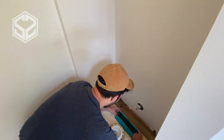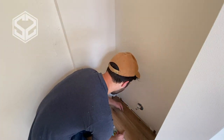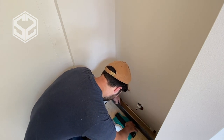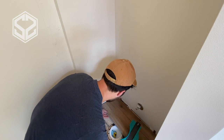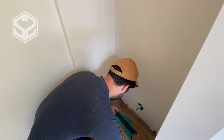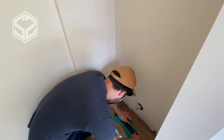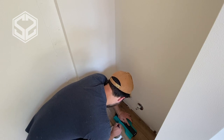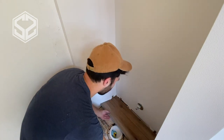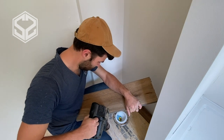Like I mentioned before, I'm starting in the corner where the toilet's going in this little cubby and I need to cut the flooring to fit around the flange perfectly. I don't want to leave too large of gaps, even though the toilet's covering it up — I want to try to get it pretty close. So I'm going to use this tool that allows me to trace the exact outline of this flange and I can transfer this now to the board on top. To cut a curve like this on the flooring, I would not recommend using a utility knife — it works great for straight edges, but not for curves. So I'm going to be using a jigsaw to speed up that process and make it a lot easier.